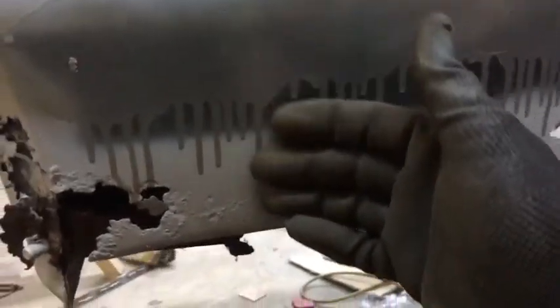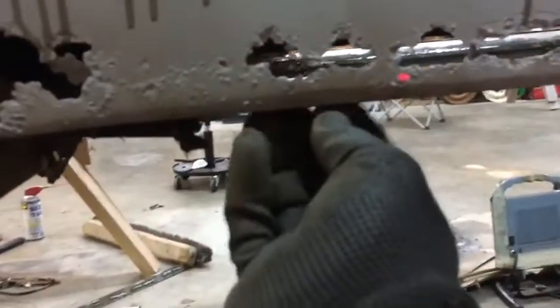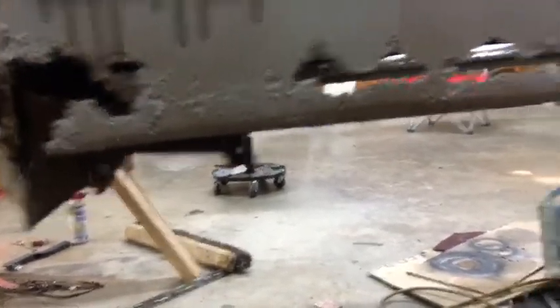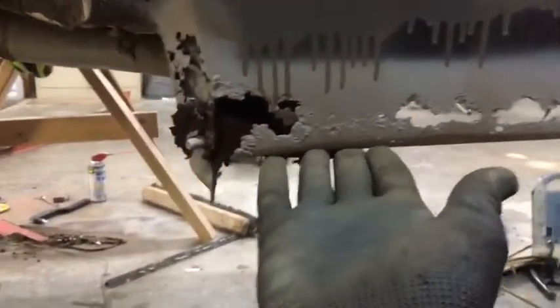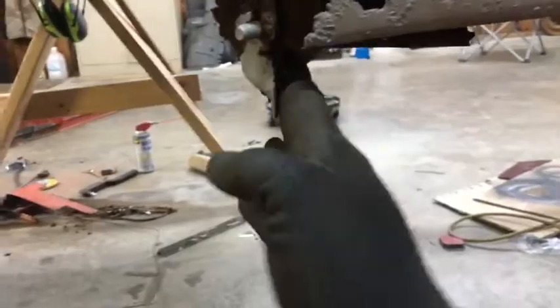When this corner panel comes down and makes a lip, there's about a half-inch piece that hangs down — that's where you weld to your heater channel. What I've done with my cutoff wheel: I just stuck that up there and cut right into the heater channel all the way back, and then I took my cutoff wheel and went in behind this body lip right here.